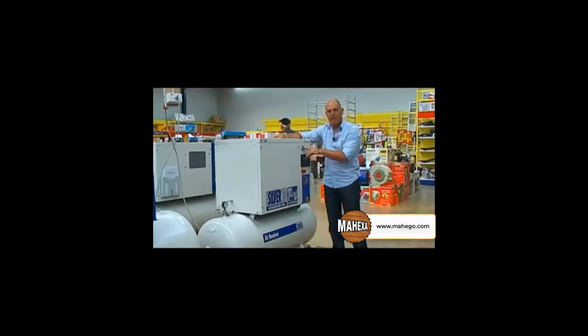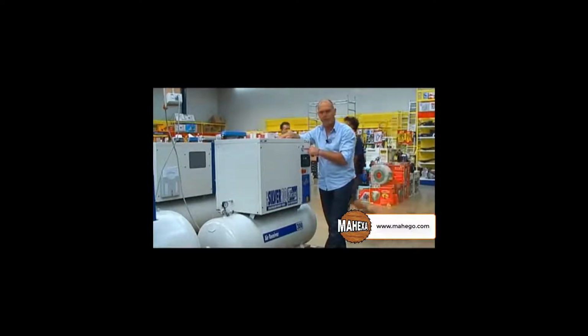So now the air pressure is decreasing in the air end, and this will continue to wind down for 2 minutes. When it's empty, the machine will stop until the air supply is needed again. One of the features of the FIAC machine over Atlas Copco models and some of our other competitors, if you turn it off, it doesn't stop immediately. It continues to run until the air pressure in the air end is down, and then it'll stop. This is a good feature because the air end cannot be damaged when restarting again.